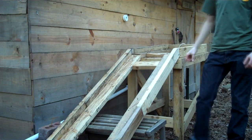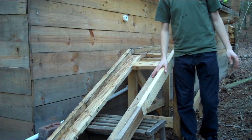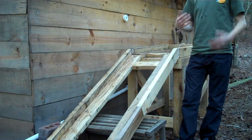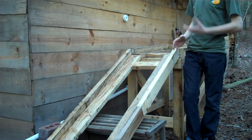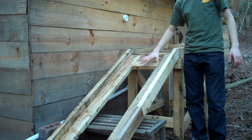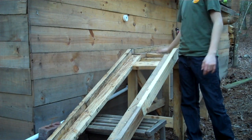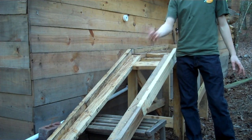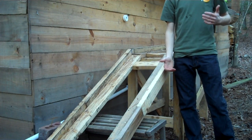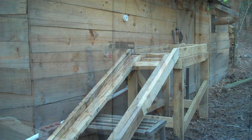This is our new water tank system. We're no longer hauling five-gallon buckets up to the countertop to use as a sink. We've got almost 20 gallons of water, and we need to be able to get it up onto the elevation that we need, and we're not going to be able to do that with one person very easily. Also it's a lot of space to take up on a countertop, so I decided I'm going with a sleeker and more efficient system. I actually built a ramp and a sitting platform for this new system. I'm going to bring this up with a pulley system to sit up on top of here, because this is 18 gallons and water weighs 8 pounds a gallon — that's quite a bit of weight, especially since I'm considering upgrading to maybe even a 27-gallon tank. But 18 gallons should be enough for me.